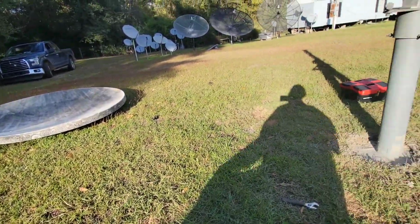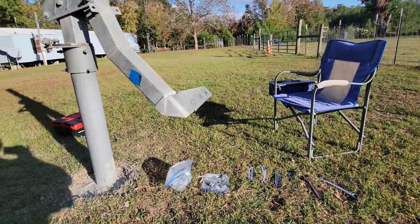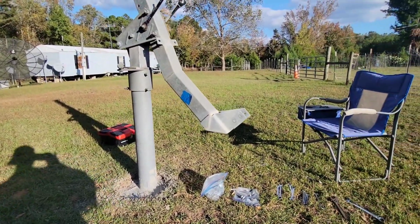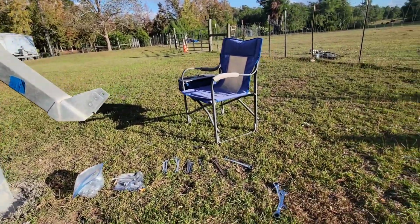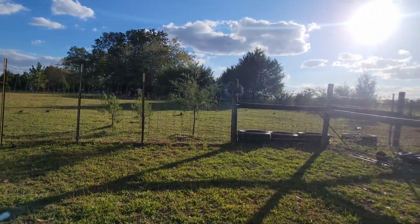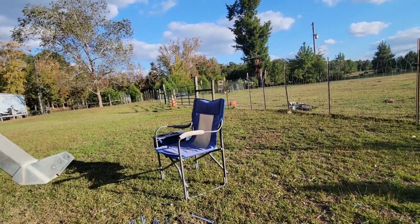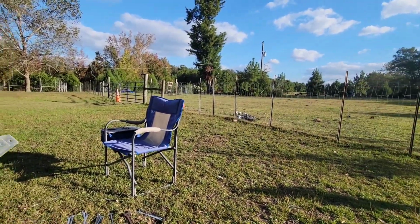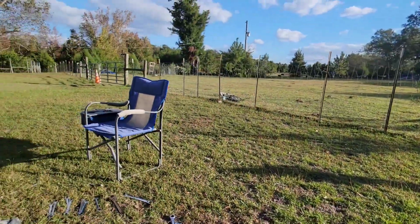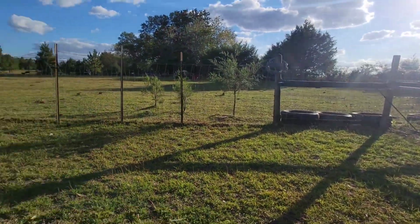If I have no luck, I might just stick this over there and point it toward the east and go for some of them Mexican, Brazilian satellites. And on Ku, seems like they have a lot more on there to offer than they do on these western birds over here in the United States. I can probably aim towards some of those eastern satellites since I got a clear view, probably from 30 West all the way to 133 West. So I got a pretty good clear view, so I can pretty much have a pretty wide choice